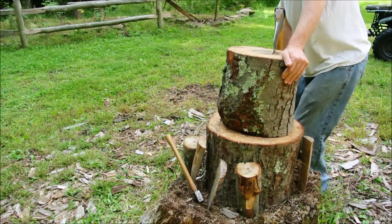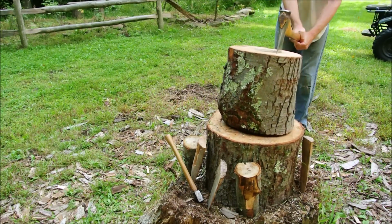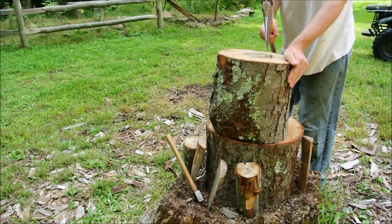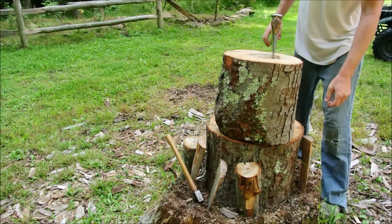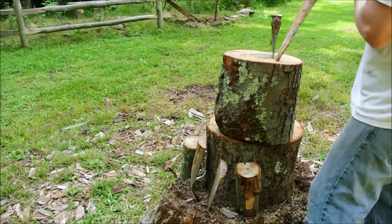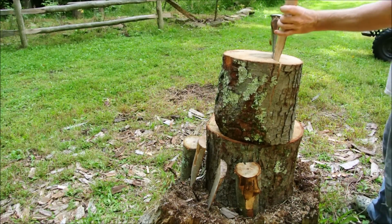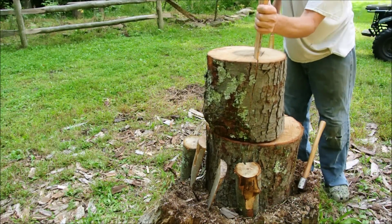Miss. I want to take a little less than that. Closer. But my check didn't go the whole way across the minor diameter. Close. This one should do it. Except I missed again. But now my check turned into a crack. So I can move forward with the wedge process. Listen to that. Again, not a struggle. I'm not working too hard.